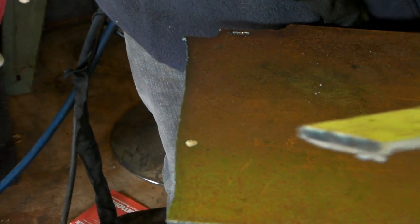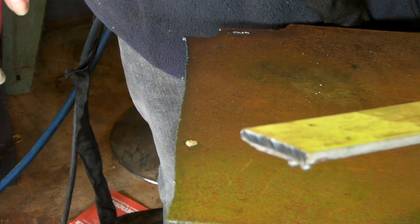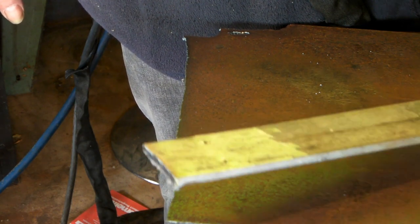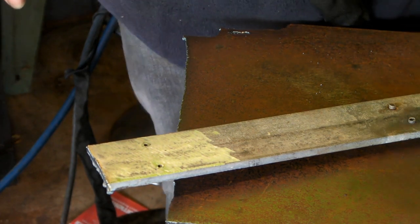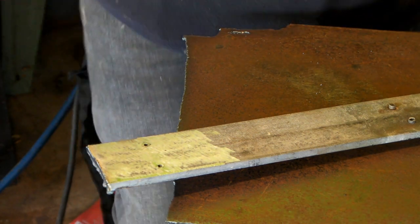Notice that — clean cut, fast cut at 40 amps. There's a huge difference between 15 amps and 40 amps, and even 30 amps there's a big difference in what you can do. I hope you've seen my comparisons — I'm just trying to give you an idea that when you buy a machine with a built-in air compressor, you're going to lose a lot of cutting power. And it's not only that — you don't get to use the compressor for other things.